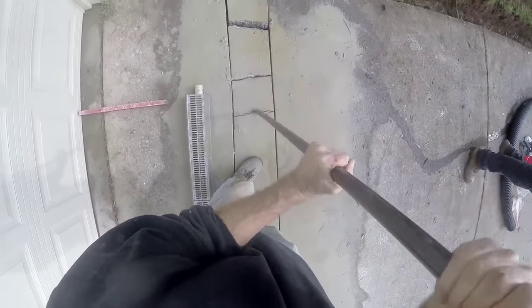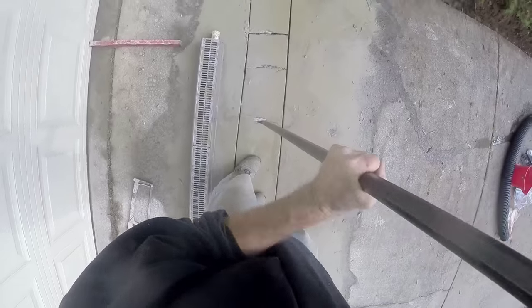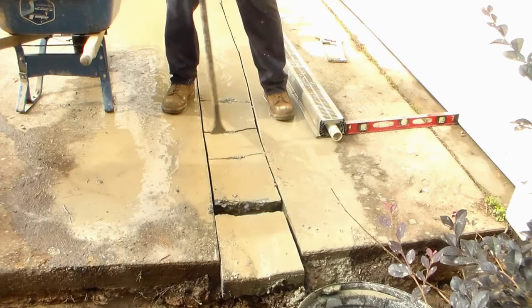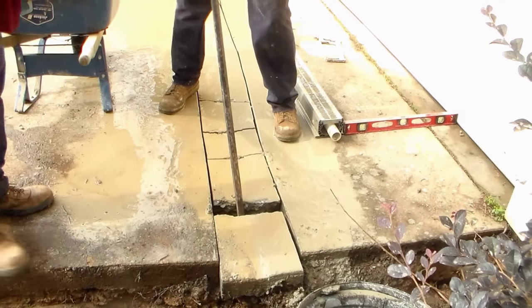It's really that simple. We pound just like a jackhammer, and that concrete will get weaker and weaker, and you can see the cracks, and then we'll pry those out with a pry bar, and we'll be ready to install the channel drain. So we've already cracked a few of them. Pry this first one up. It's ready to go. Yeah, pry it up there.